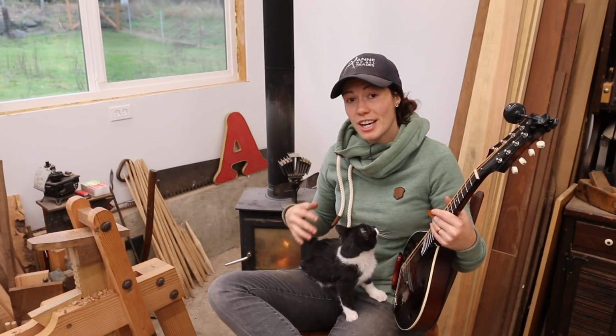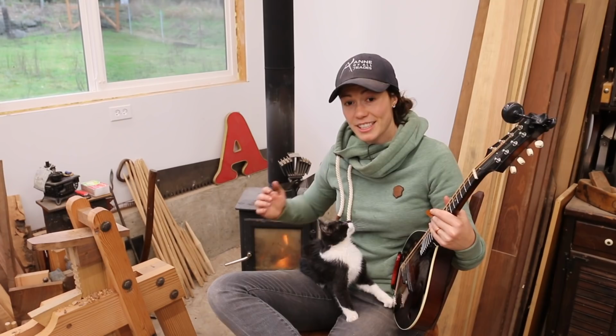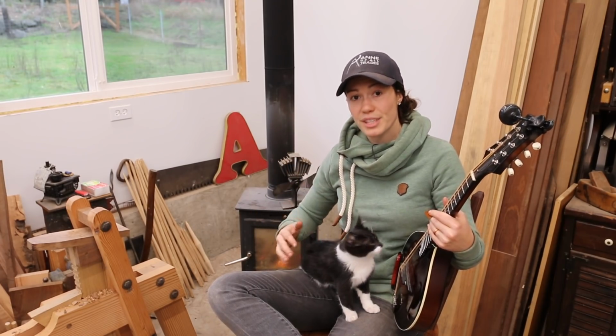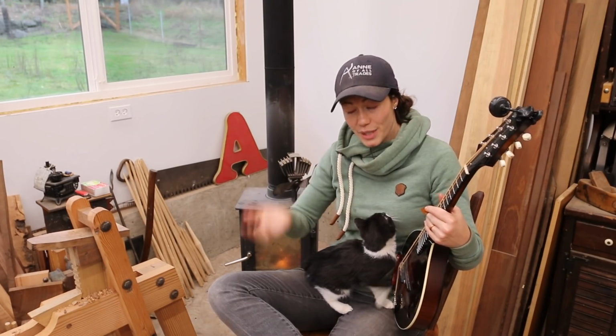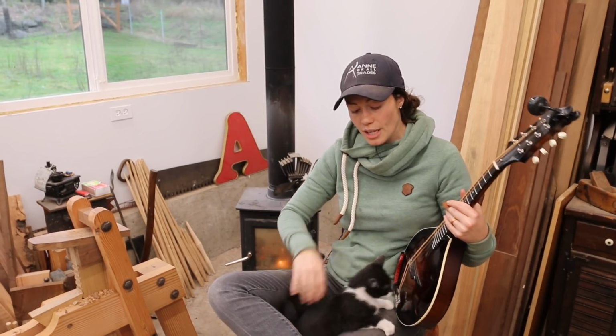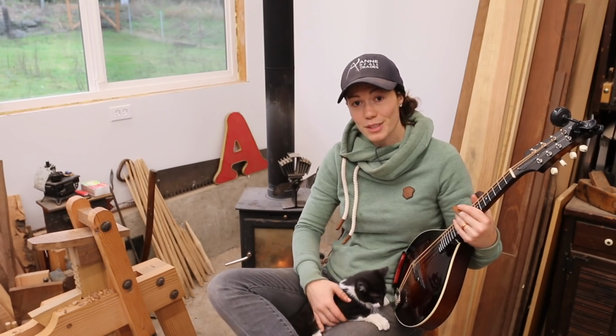And even though this chair is sculpted out of dry wood, there's still a lot of things that you want to take into consideration. You want to cut your wood out of the correct portions of the tree so that you're getting the maximum amount of grain strength. And that is going to waste a whole lot of wood as far as material conservation goes, but it's also going to get you a chair that's going to hopefully last for 100 years, even if some of your larger relatives sit on it during the holidays.